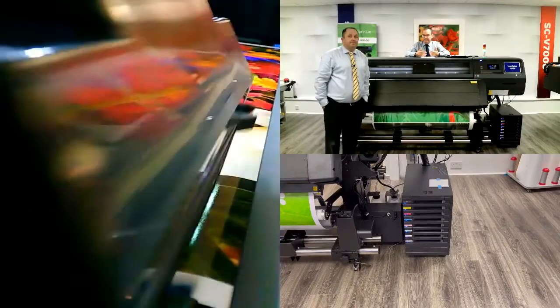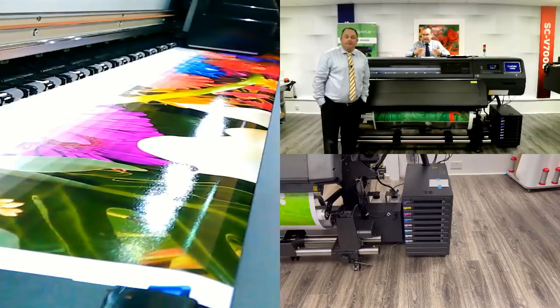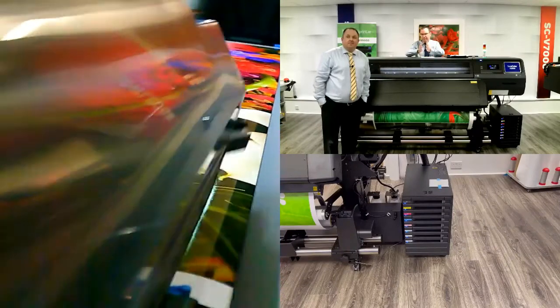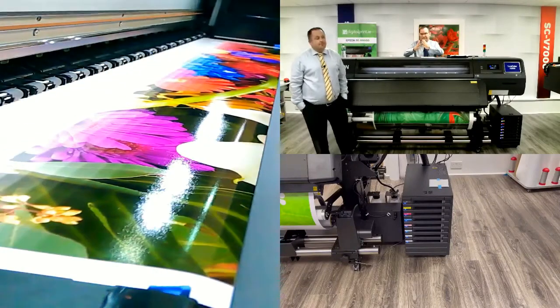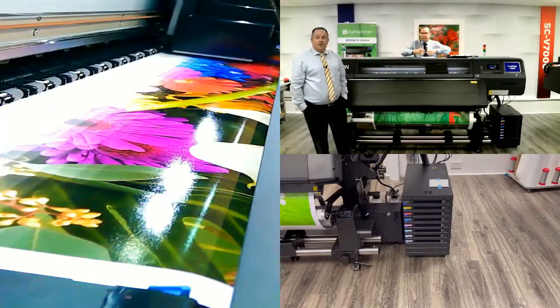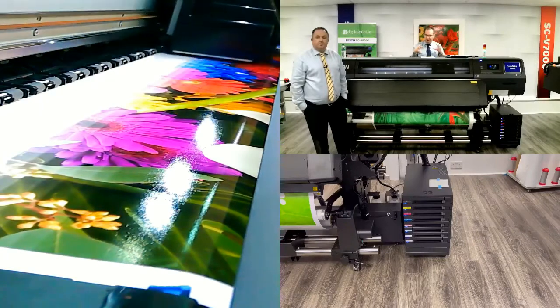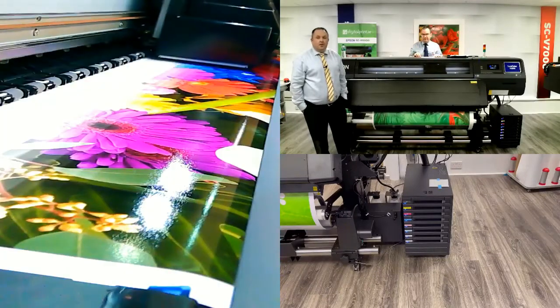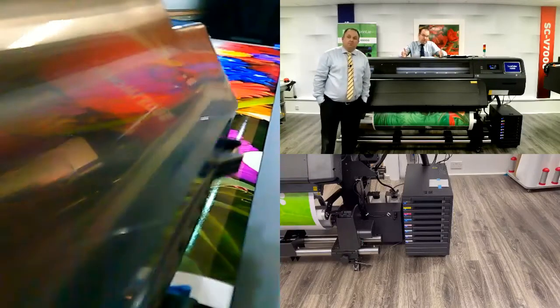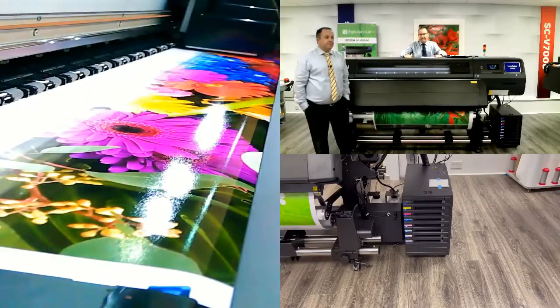And the R5000L has 12 ink slots, each taking 1.5 litres, but they're bought in packs of 3 litres. So 2 by 1.5 litres per box with a hot swap, so that you never have to pause your printing when you're changing your ink. So even the entry level, if you like, the R5000 is bulk. The R5000L is super bulk.